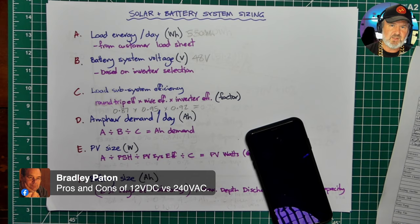It does limit you in the sort of appliances you can get. They are generally designed for RV markets. But when you look at a tiny house, it's not that much different than an RV. So small cable runs, therefore voltage drop isn't such a big issue. You'd likely have small loads, like just a couple of lights, not a whole house full of lights. It does mean that you've got a guaranteed way of keeping those appliances running independently of the inverter, which means the inverter losses aren't considered. So that's a gain. And also, if a calamity happened, like your inverter failed, any DC appliances like lights, maybe a water pump even, won't stop working. So that's a bit of a bonus.